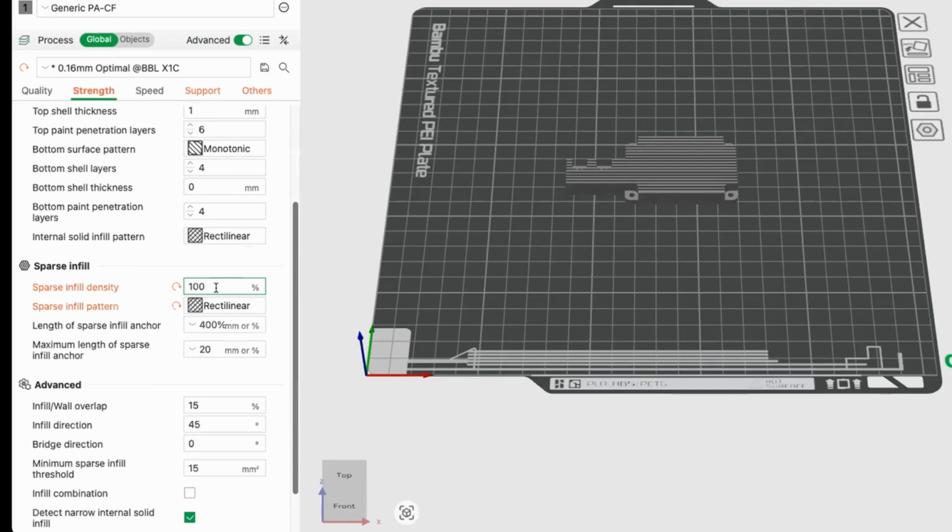Depending on the part, if it's going to be something that has infill and everything, you're probably going to want it to be 98 to 100% infill because you want it to be solid to transfer that heat. When we do heat sinks, we actually try to design it and print it so we can just print everything as a perimeter. I can go over that a little bit, and what we would do with your part, a little bit later.